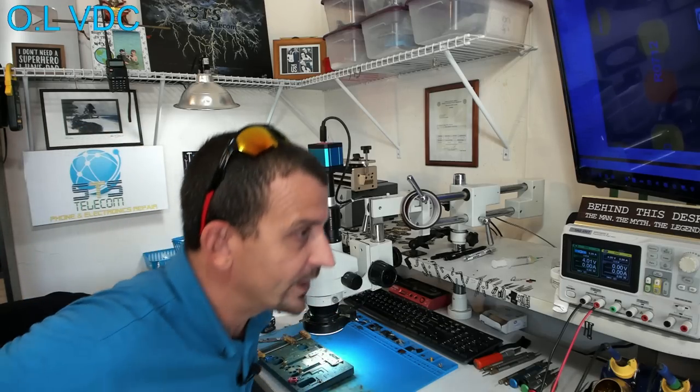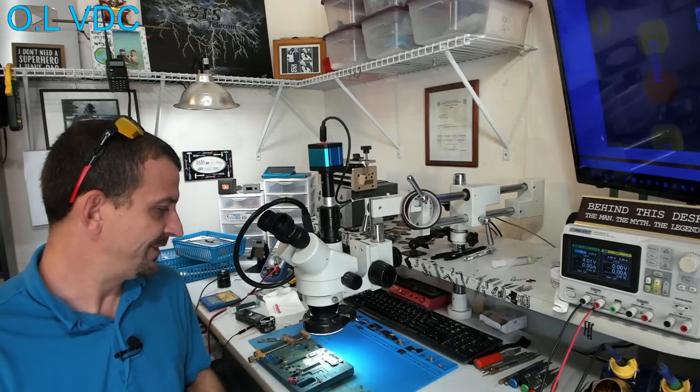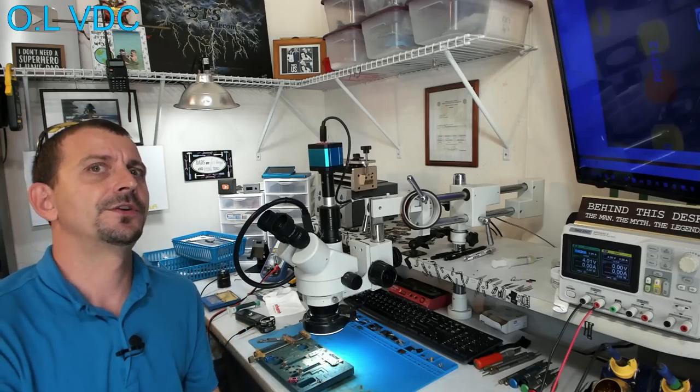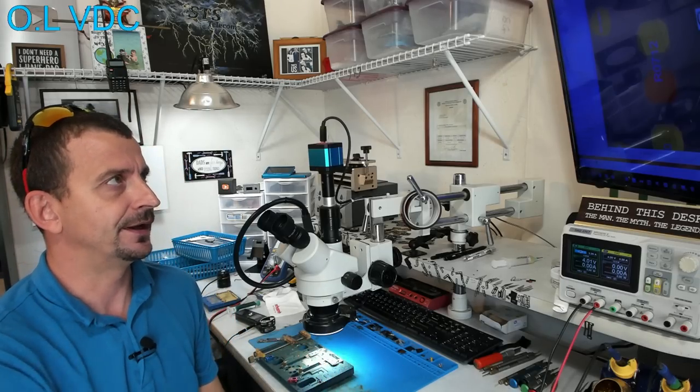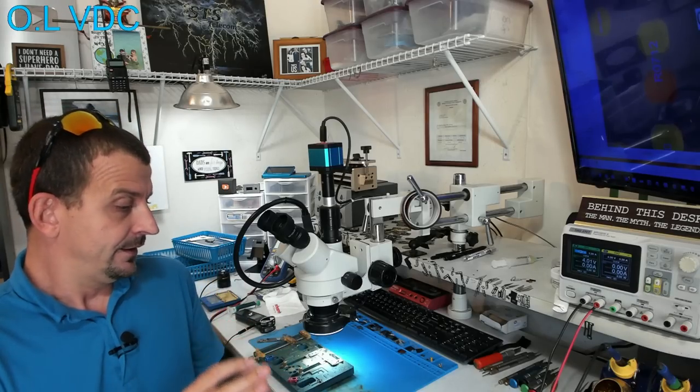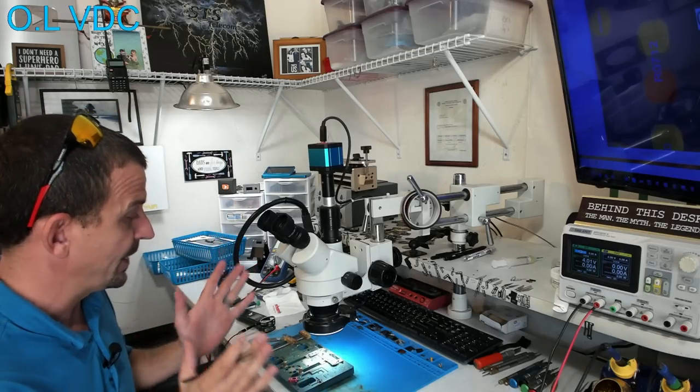So what I'm going to do here is swap this over to a known good logic board, only I'm going to have to convert that known good logic board into the European, or other side of the planet, version so that it'll work. So join me, start warming this up. I'm first going to remove the NAND, we'll pull the CPU, and then I'll go after the smaller components.